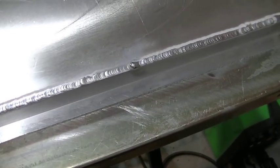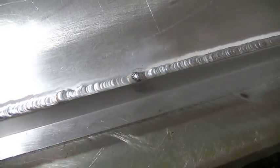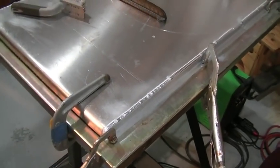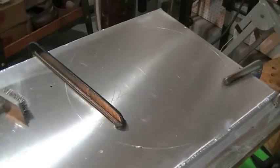I'm not going to grind or smooth the welds out. I did have one little hiccup where I dipped my tungsten, so I had to flip the tungsten around and just motored on. We'll let this cool down — I'm going to grab some lunch and then come back. Next thing we've got to do is cut out the big hole here for the electric fan.